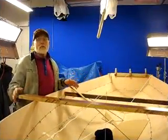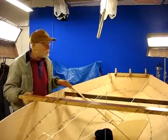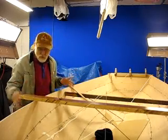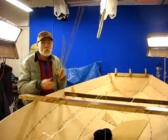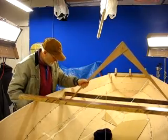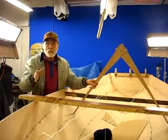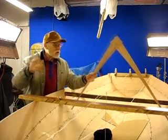The thing I have to do now, as I'm drawing up the plans which I've been working on the last couple days, is drawing up all the lines so you get your plan and profile perspective views of the hull. I've got to go around with my tape measure and a set of dividers I made from old strips of plywood, to measure the distances between these ribs at each elevation along the beamline. As I'm drawing the plans from my overhead view on the computer, I can draw in the arcs and the widths.